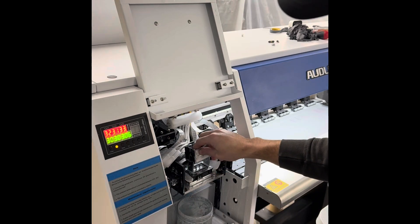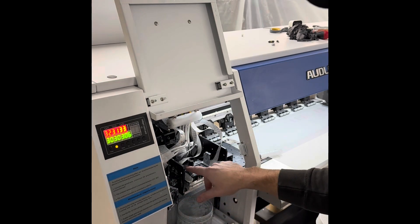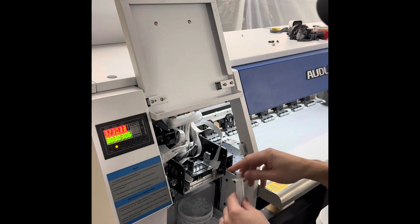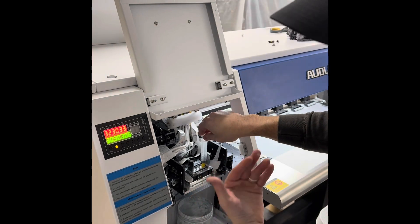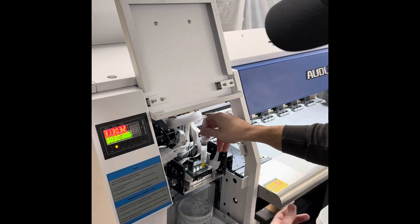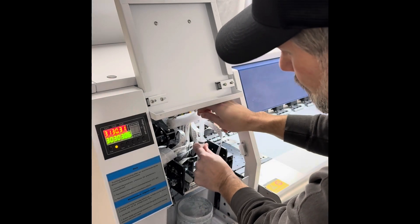Disassemble your heating system by just lifting up. If you don't have yours loose, it might be tightened down — just loosen those screws to get that up. As always, the first thing we do is we pull up this way to get anything that's jammed into the screens. You can see all that white ink and chunks pulled out. I'm going to do it again — pull up.